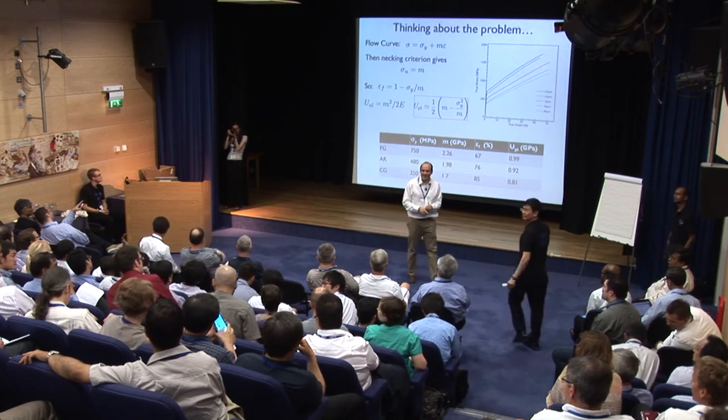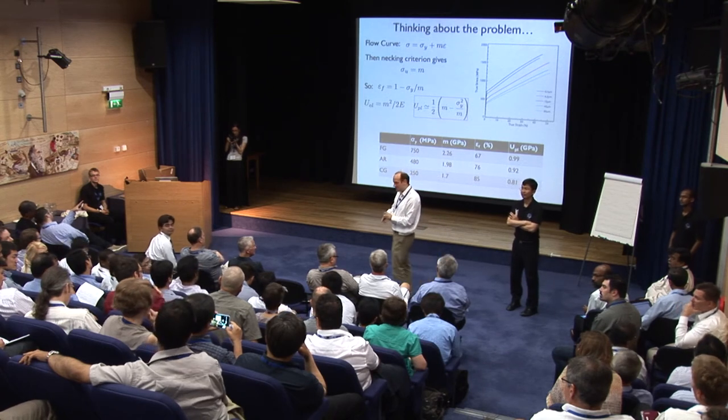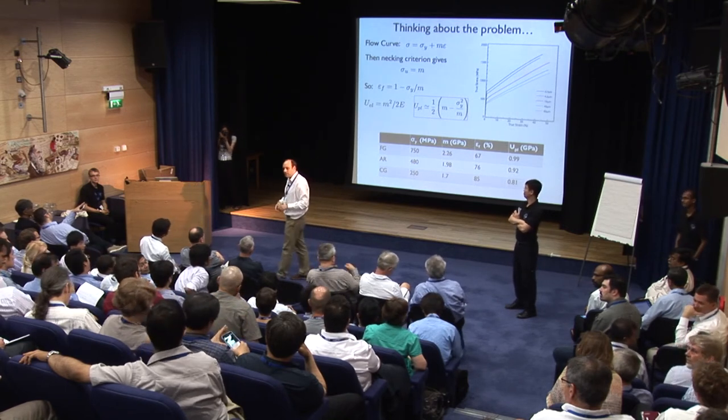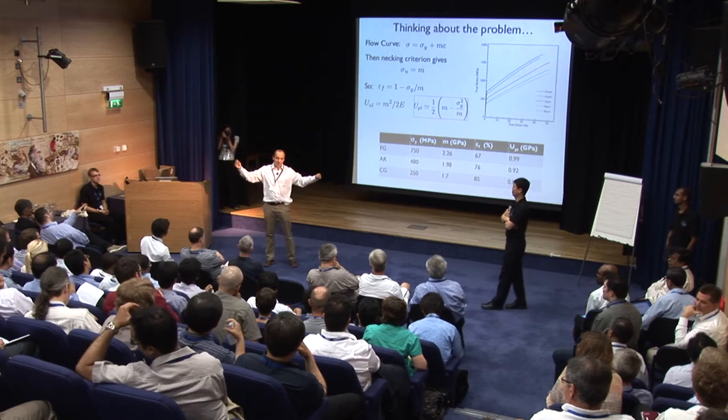As long as twinning is correlated to the crystallographic direction, did you check if your hardening rate is as beautiful in non-one-dimensional deformation? Biaxial, for instance. Okay, so that's one of the interesting things about the blast test. You can go and look at the sidewall as well, and you can go and look at the bend around the corner, and you get a very similar story.